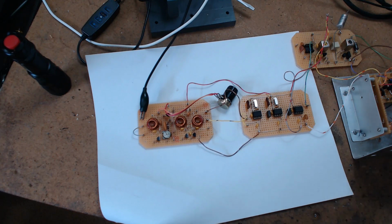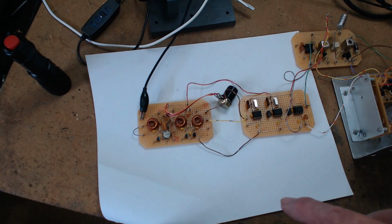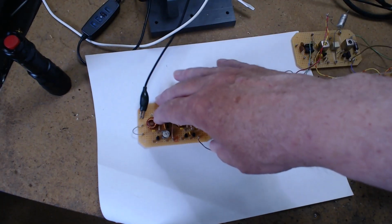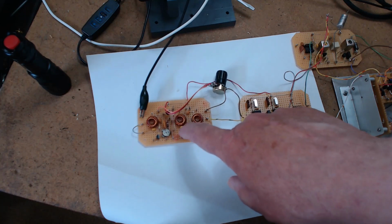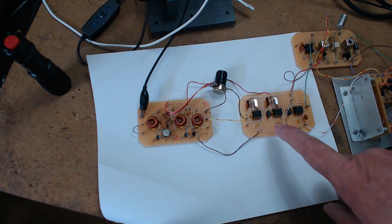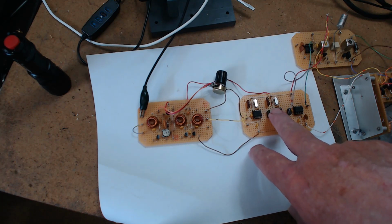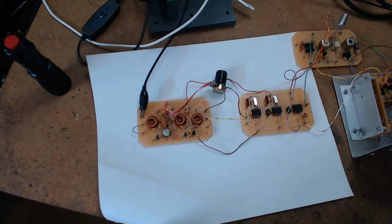So you come in the first coil and you tune. This unit tunes between 3 megacycles and 8 megacycles. You tune it with this knob for say 3 megacycles, and then this allows only 3 megacycles theoretically to get through, gets amplified, goes through 2 more stages of filter. It's an RF filter, and then it goes into your mixer and the crystal oscillator, which basically down converts the band that you want to receive, and then it gets inverted. The band gets inversed, so I can use a digital frequency counter.